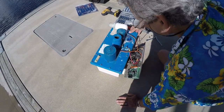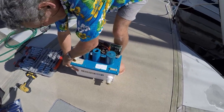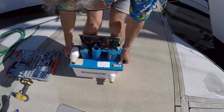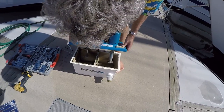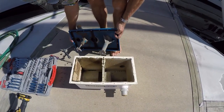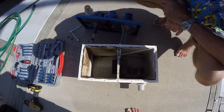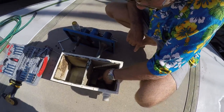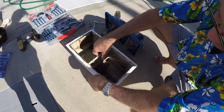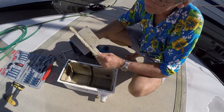See how we go about getting the lid off this thing. And there we have it. The inside of the unit, which is remarkably clean, and this is the electrode pack here, and the fins on it are heavily coated in gunk, so now we just got to replace that. This theoretically slides out, and that's the cause of the problems, we hope.